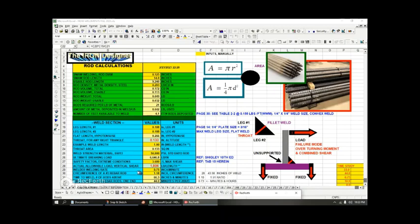And the welder welding rate is in here because I'm trying to compute the welding speed manually of the rebar rods to the plate. And it comes out to, say, in this example, 66.3 inches. And it's also minutes because I'm doing a certain weld rate per minute here, and then it's telling me that in order to complete the job, this assignment would be 44 minutes for the welder.